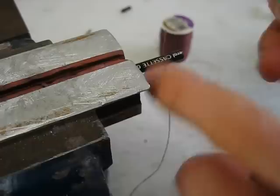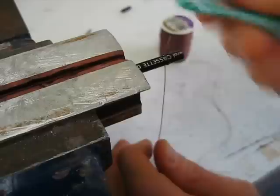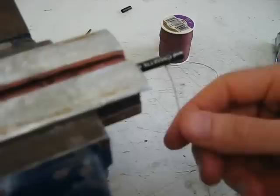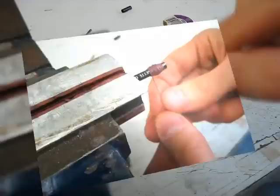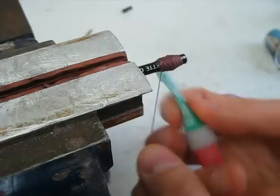I put the nylon thread — I just tied a loop around a fresh piece of my bushing material here, with some crazy glue, and I'm just going to put it around that loop there. That seems to have held quite nicely. Now I'll just start winding it here. I made it lumpy in the middle — rounded — because that's what holds the rubber band on. I'll put some more glue at the edge here since it seems to work quite well.